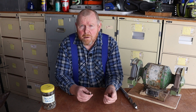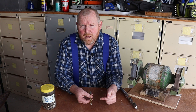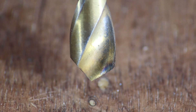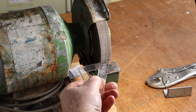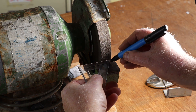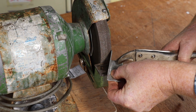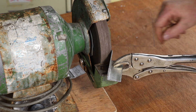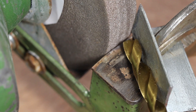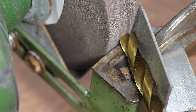When we're freehand sharpening, the most difficult part of the process is grinding both sides of the point to the same angle. If we grind the cutting edges at different angles, then only one of them will be in contact with the hole, which is inefficient and also tends to make non-circular holes. To help us grind both point angles the same, we'll start by marking a 60 degree line across the tool rest, then clamp a short piece of 25mm angle steel to the tool rest using these vice grips. Now we just need to hold the drill bit up against the guide and we can be fairly confident that we'll be grinding the correct point angle onto it.